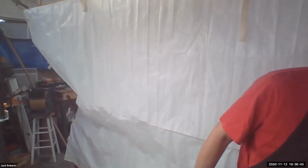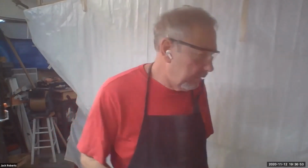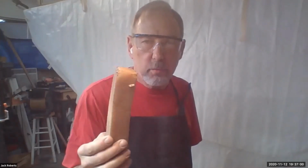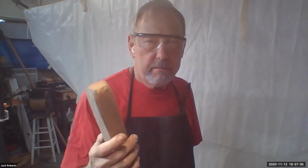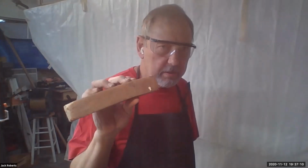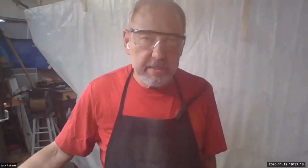All right. Anybody have anything you think I ought to mention before we get going here? Do you have to clean your CBN wheel at all? No. They do make a product for cleaning it, a rubber block. I actually use just an eraser wheel like you use to clean sandpaper occasionally. And they make some other products. I have never used them. This is all I've ever cleaned it with, and I haven't had a problem. So I don't know that that's the correct answer, but that's what I do.